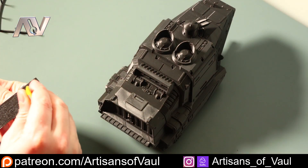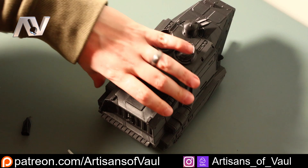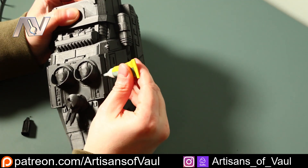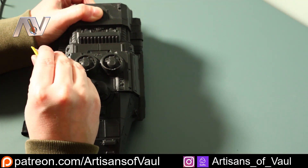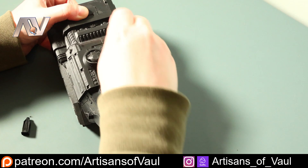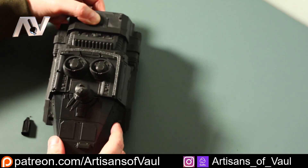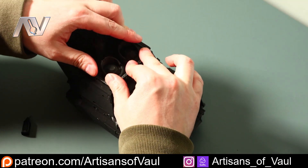With that issue sorted, we got fully into 3D printing. I carried on with some War Scenery stuff — this is from their new Kickstarter, which is very Star Wars themed, but I'll be using it mostly for scenery. I printed out this tank, which goes together really nicely. It doesn't need any supports at all — it prints all flat on the print bed, which is great. And it was while printing this tank, specifically the railings, which are designed to be printed without any supports so all of the railing legs are facing upwards away from the build plate, that I realised the other really big positive of this filament. I hadn't tried to dial this in much at all — I just stuck with my normal settings. And there's almost no stringing with this filament. I think I could probably, with some tweaking, get it to the point where there's none.